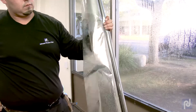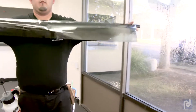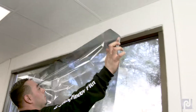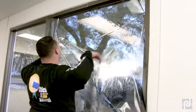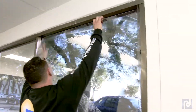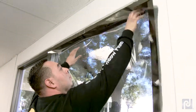Pinch the exposed adhesive and release liner on both sides of the roll. Lift the roll above your head and gently force the roll towards the floor. This should cause the film to unroll and simultaneously release the liner to the hard coat side of the film. Rapidly apply the film with exposed adhesive to the glass, being sure to overlap the film onto the frame so that no exposed glass is showing. Carefully remove the release liner from the hard coat side of the film and peel any remaining on the adhesive side along the bottom and discard.